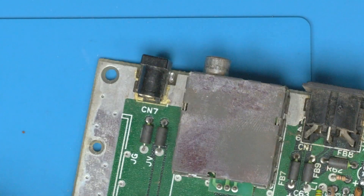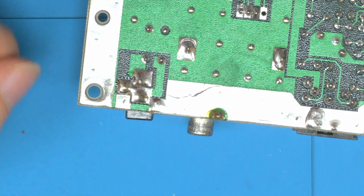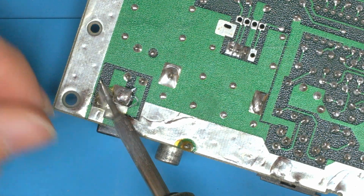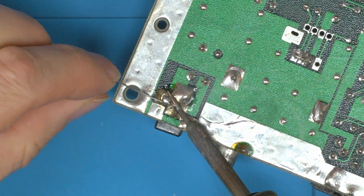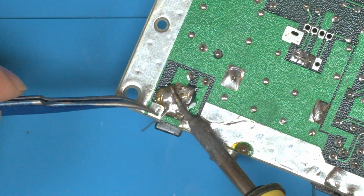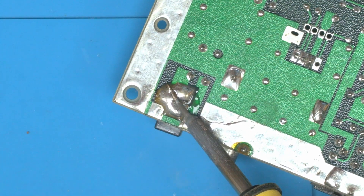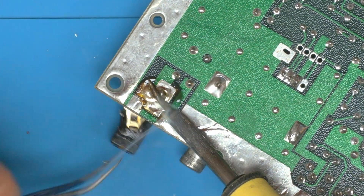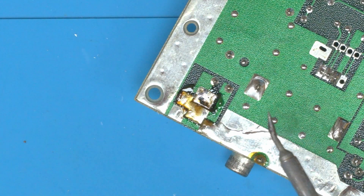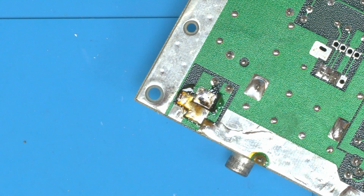With that done, the next thing is to remove the old DC jack. To remove it, we'll flood it with solder and then remove it. You can use hot air, but I'll show you the way to do it with just solder since quite a few of you don't have hot air stations. Just flood the entire area with plenty of solder and try to bridge all three pads together. Leave the heat on until you have one big pile of solder warming all three pads, then it's off. With hot air you'd tend to get it off in one go, but it may come apart in bits — that's fine since we're not reusing it.